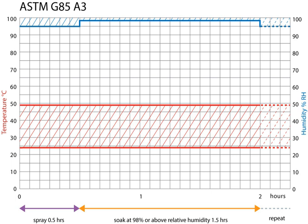Most commonly, the time taken for oxides to appear on the samples under test is compared to expectations to determine whether the test is passed or failed. For this reason, the salt spray test is most often deployed in a quality audit role, where it can be used to check the effectiveness of a production process, such as the surface coating of a metallic part. The salt spray test has little application in predicting how materials or surface coatings will resist corrosion in the real world, because it does not create, replicate, or accelerate real-world corrosive conditions. Cyclic corrosion testing is better suited to this.